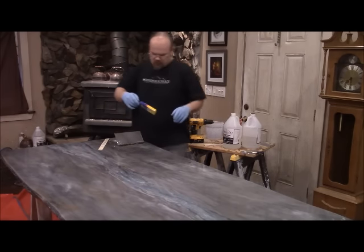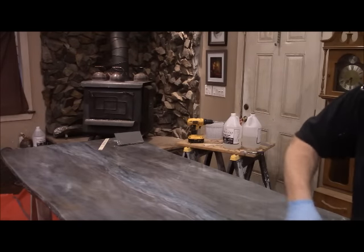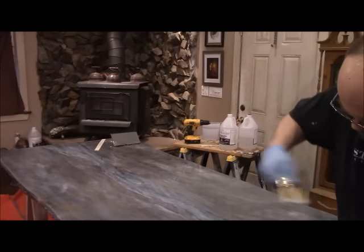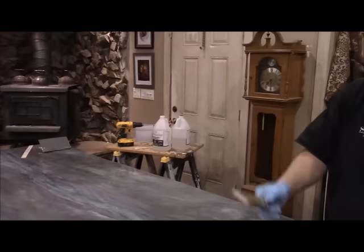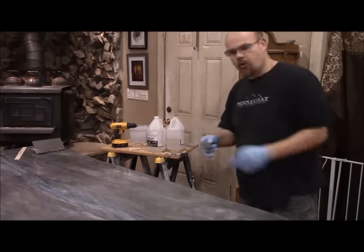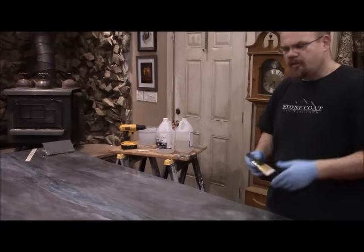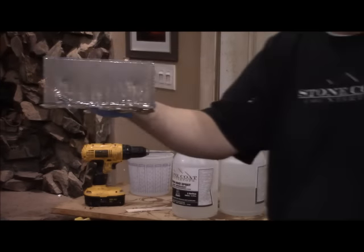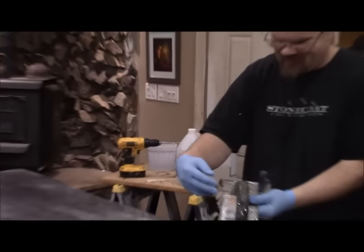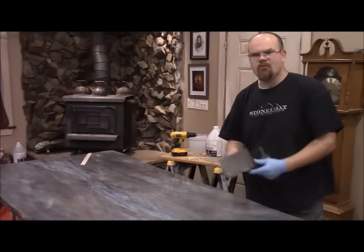These are the brushes I like to use — a Wooster Shortcut, which I get at Home Depot. It's a nylon bristle brush. When you open it, pull any loose bristles off — they don't shed too bad but they will a little. These are throw-away; you're only going to use it once. I like the little rubber handle — it's easy to do the effects I like. The trowel is a 1/8 by 1/8 square notch trowel, the kind I like for spreading material. I use it over and over; when I set it down I set it so drips run away from the notches.